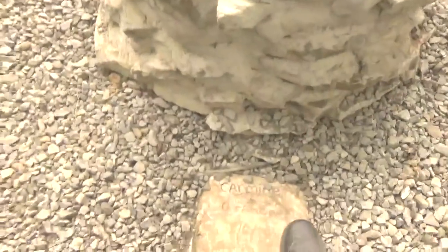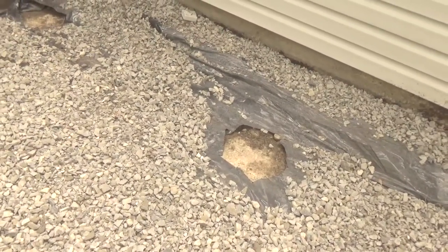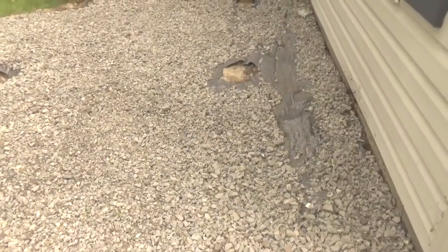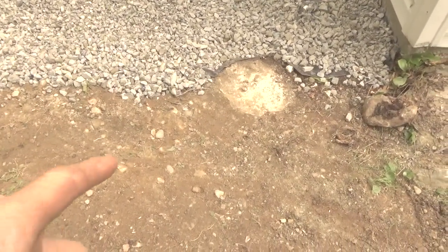You can see there's concrete in the bottom of these holes. My one neighbor said he would dig these holes and he did dig them for me, and I appreciate that. But it didn't give me enough time to really figure out the height of everything and grade it all off. I could have made this concrete exactly even with one another, but I didn't. I did take a shot on top of them with a rotating laser, so I know where they are in relation to one another — I just have to cut the boards accordingly. Out in here the deck won't be that high, probably about eight inches — it'll be like a step so you'll be able to step right down onto it.